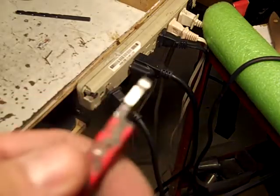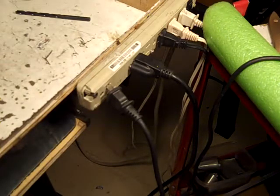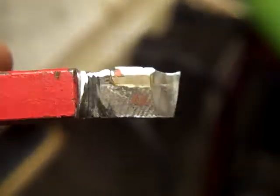Now here's a carbide. I'm going to put the magnifier on for that, just to show you some of the work you can do with these things. And you can be creative. They're cheap. You know, these carbide bits are pretty expensive. I think I bought six of them for $16 at Harbor Freight. But see how I cut that tip there? I experiment a lot. And I have a mini lathe, and it's hard to find a mini lathe parting tool. So I basically shaped that tip the way I thought, well, that should cut. And that's carbide. You know, the diamond just grinds right into that like it's nothing. And nothing else will cut that.